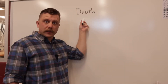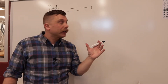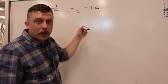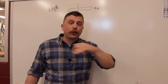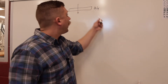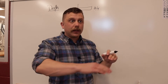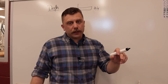When talking about profile cuts on a project, there are a few things we have to specify: depth, the bit, and the line. For the depth of the cut, if the wood is ¾ inch thick, we don't want to go through and into the table below on the CNC machine — but for a profile we have to cut through the wood. So we go just far enough to get through the wood and cut the table a tiny bit, which is why we have a sacrificial piece on the table. You'll notice there are a bunch of cuts in the table already — that allows us to go through the wood without damaging anything.